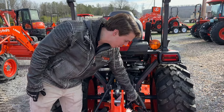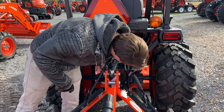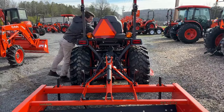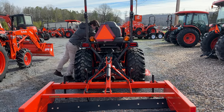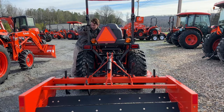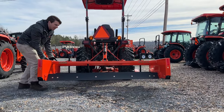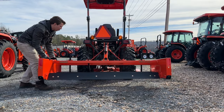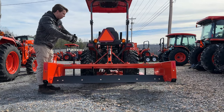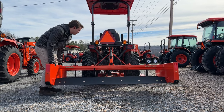This is a smaller tractor, but it still has one adjustment arm and one top link, just like the other ones. Because those arms are locked in, there is very little sway back and forth. If I didn't have those telescoping stabilizers locked in, this is going to be all back and forth — you don't want to have that much play to it.